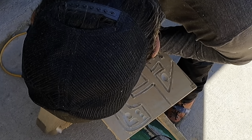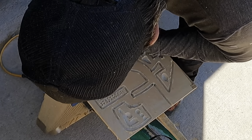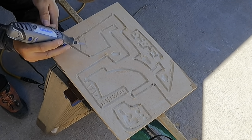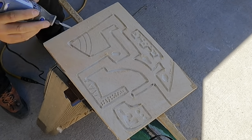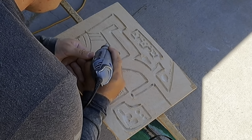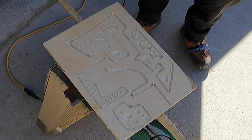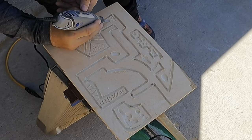If I had been doing finishing work on these panels for other specific needs, then it's a definite concern that the extreme discs can tear things out. Even the coarse and fine ones can tear out because there are a lot of variables with plywood — like how well the glue was applied in certain areas, how strong the grain is in that particular area, and which direction your bit is going. So keep that in mind with these panels. They are very good, but you have to know your limits with them and be cautious about the angles you use the bits at.